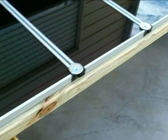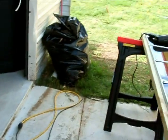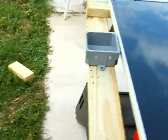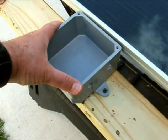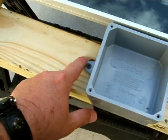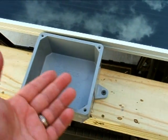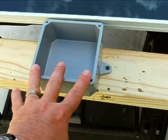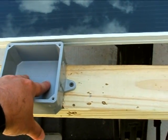You can see they look pretty good back here. Now the junction box I was talking about earlier — I'm in the process of putting it in. I got one that's fully closed and put a twin screw here. You should actually use a one and five-eighths inch screw — two inches is a little bit too long, but that's okay — and we're going to put the bus bars in here.